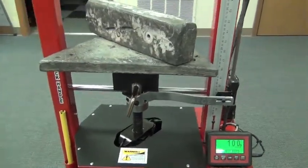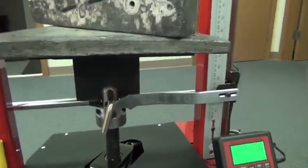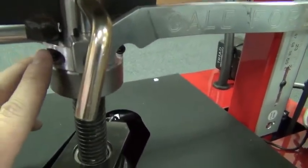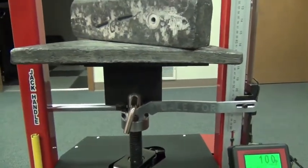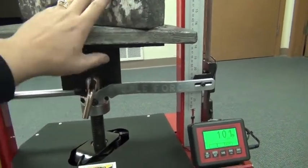As you can see, we've got our weight added — our hundred pounds. You can see where we put our platform on. On our particular platform, if you look right here, you'll see two nuts welded — that just sits against this collar so that the plate doesn't have any movement in it. The important thing is that we have exactly a hundred pounds with our platform and our lead.